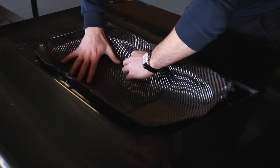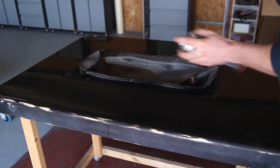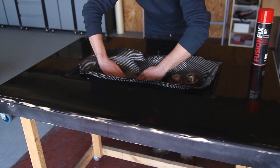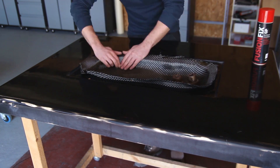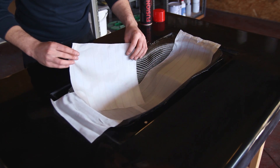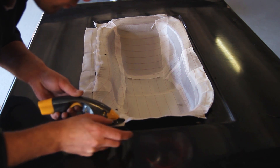Here it's positioned into the mold and then you can add the second layer. Two layers will give me about 1.3 millimeters of thickness. Then you can apply a bit of spray glue — just a bit, because sometimes when I see people having trouble with the finish on their parts, it's mostly because they use too much spray. Never use it directly onto your molds; use it in between layers and just a small mist, because it leaves residue that can fill bridging with a bluish-white milky epoxy resin — so the less you use the better.